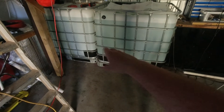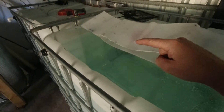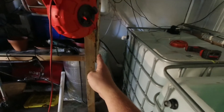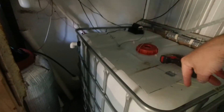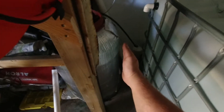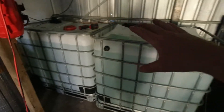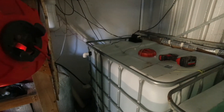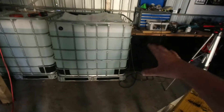Someone commented that I should be using the bottom drains for drain and fill — there are two reasons I'm not. These IBCs will be linked into my water system as basically a drip and overflow, so I can't create an overflow from the bottom. The other reason is I can't turn these IBCs that way — from there to that post is only about 350–400mm, and the IBC is 200mm bigger one way than the other, so it would have blocked corner access. At the end of the day, I was working with the space I had and really had no need for the bottom drains.